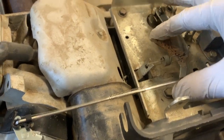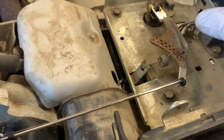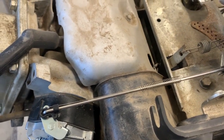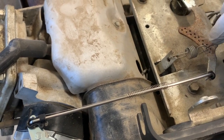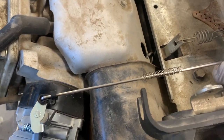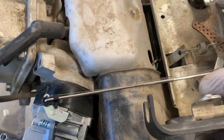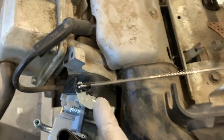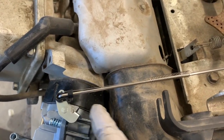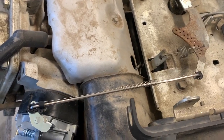I also want to run this without the fuel tank on it for a little bit first because I don't like the way the assembly feels — everything seems too tight. When it fires up, if it tries to run at full throttle I'll know the spring is too tight. You've got to hold this assembly back and set your idle speed screw until it idles fine. Then if you let go and it wants to accelerate on you, start moving this spring down until you find that balance. I don't like doing that because it's a long process, but I do what I need to do.